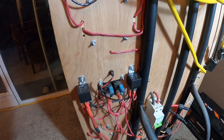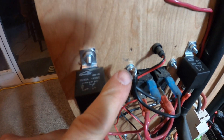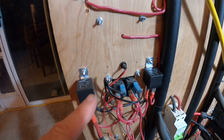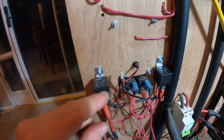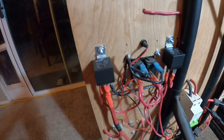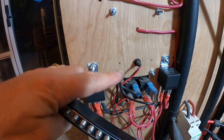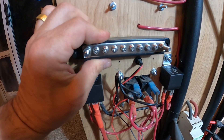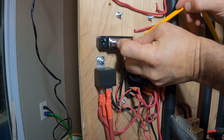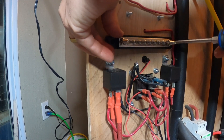We're looking at the back of the power station, and here's the blob connection. It's basically all the negative connections blobbed together. If you want to see a link to the current schematic of how this is wired, I'll put that in the description. The negative bus bar we're going to do first because it has the most number of connections and it's the biggest problem currently. We're going to install our bus bar right about here, and we'll start by drawing a line to make sure the bus bar is level.